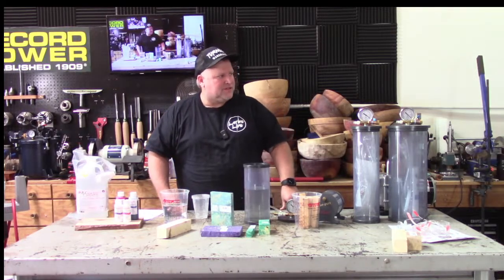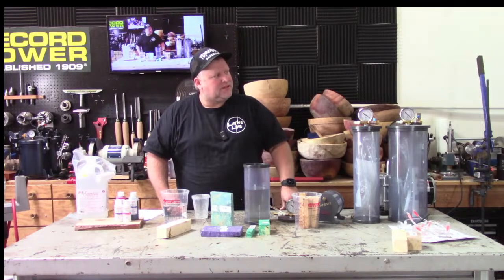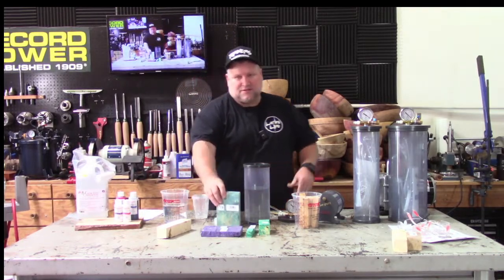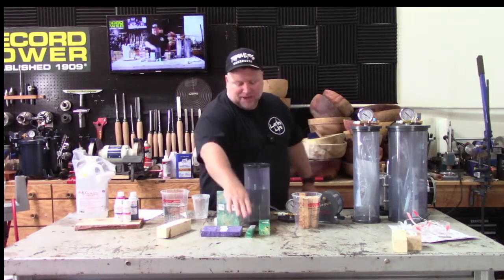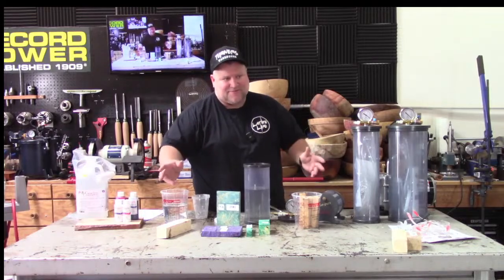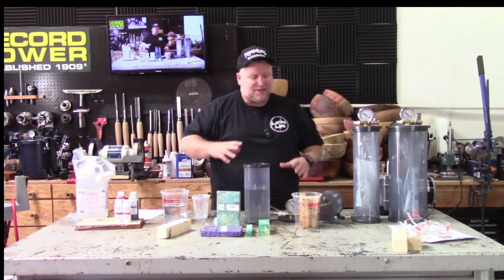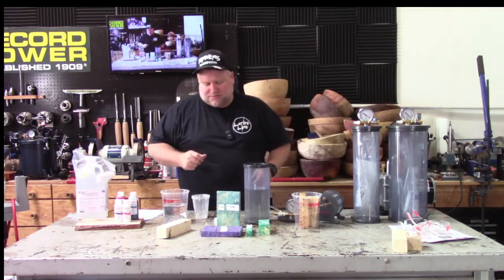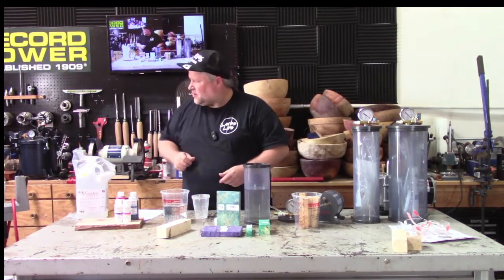But when you're going to a larger piece of wood, the time in the oven is going to be longer to keep it up. Yes. Now, the size of the blank in the oven will definitely change the time. So a pen blank might take 2 or 3 hours, where a big blank might take 5 or 6 or 7 hours. Absolutely. So that's more of a size thing than a wood type thing, but it definitely will affect it for sure. Did you have a question?